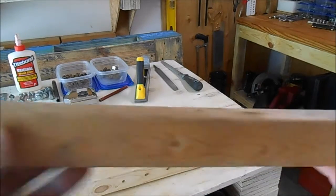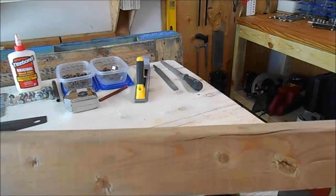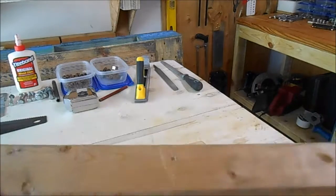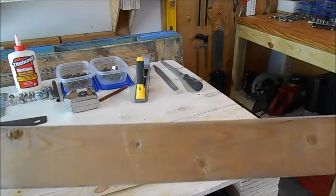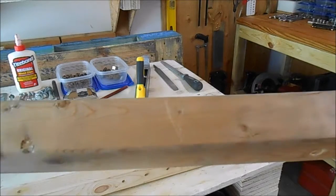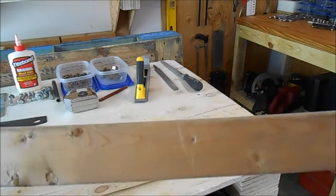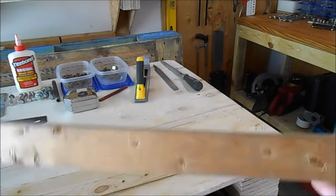And this stock had been sitting outside under a tarp for approximately 3 months. And I was trying to preserve it, but the humidity during the summer finally got to it, and it began to twist and bow. So this is the best stock of this that I have, and I think that the concept is that it sat outside in the humidity. It got seasoned a little bit. It worked and twisted just a little bit. I still think that this piece is something I can work with. But then it sat here in the garage, and I acclimatized it for another 3 weeks as far as that goes. So it's obvious to me that the weakness in this design is this particular handle.